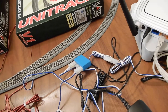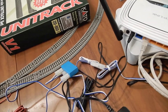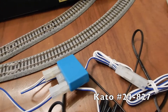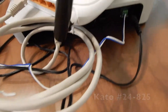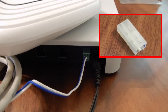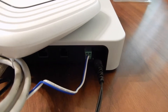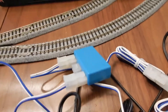The idea behind this is to keep things as plug-and-play as possible. To keep things from being too complicated, we're going to use extension cables to do a lot of the work. Here we can see we're using a Kato three-way extension that is then plugged into a normal extension wire. We follow that around, clip off the end, strip it down with the wire strippers, and insert that into the back of the Z21. The only thing we're modifying is this extension cable right here.